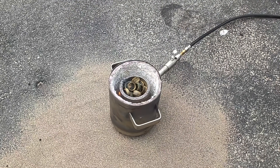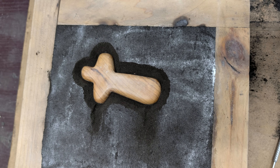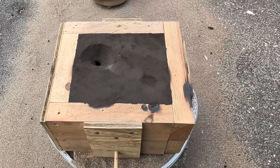Just like in last week's video, I did not film the making of this sand casting mold — it is quite extensive and pretty boring. You can see here I still have the wooden pattern in the sand mold. I carved out the perimeter of the wooden pattern because it has no draft angle, which allows me to remove the pattern without pulling any sand out with it. Here's a picture of the top half of the mold where I added a riser at the end of the runner, which will hopefully feed the brass with more brass as it cools and eliminate any shrinkage.